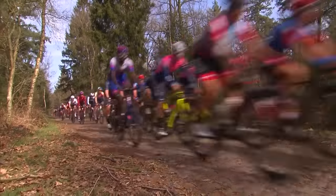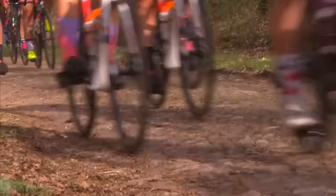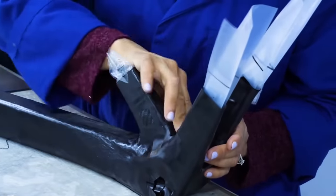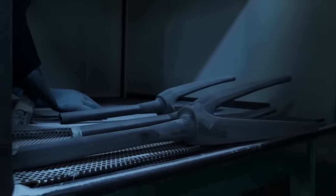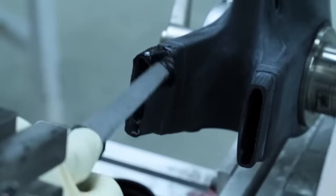Not necessarily, because the stiffness that you're getting depends on the layup of the fibers and the orientation of the fibers with respect to the load. It's achieving that deflection essentially with the fibers carrying all the load. The matrix just holds the whole thing together, but it's the fibers that are carrying the load. And in fatigue, it is essentially the matrix which is failing, and the interfaces between the fibers and the matrix which fail. Eventually, the fibers do start to fail, but it's a damage process largely in the matrix.